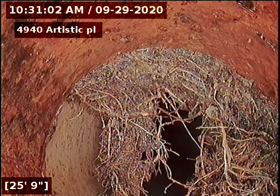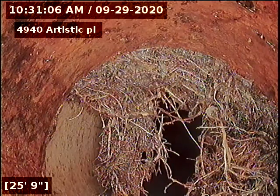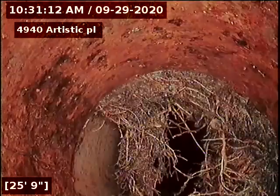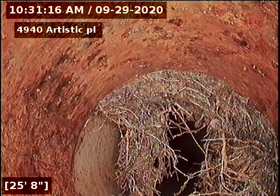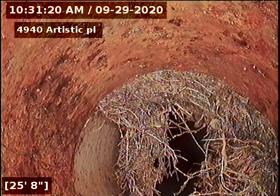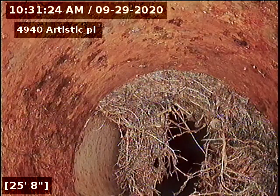I recommend replacing roughly about 15 feet of pipe from this transition to where it ties into the ABS. Install proper four-inch two-way outside clean outs to clean the line a lot better. We can only get a three-inch cutter because we only have a three-inch opening. Working on estimate.